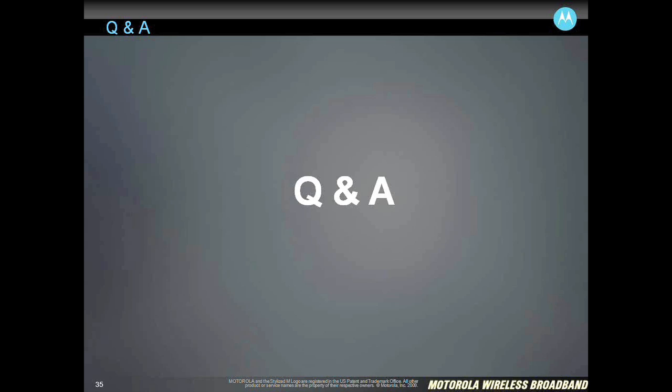And I guess to add on to that, the PMP320 access point, as an example, uses less than 25 watts of power. I think the 430 is similar, 22 watts. So it's very similar. So these are very low power consumption at the base station. And then, of course, the subscriber modules are significantly lower than that as well. So I think certainly solar powered is an option with these types of products.